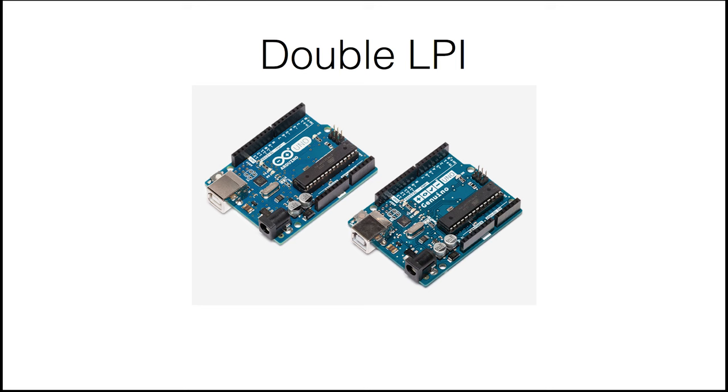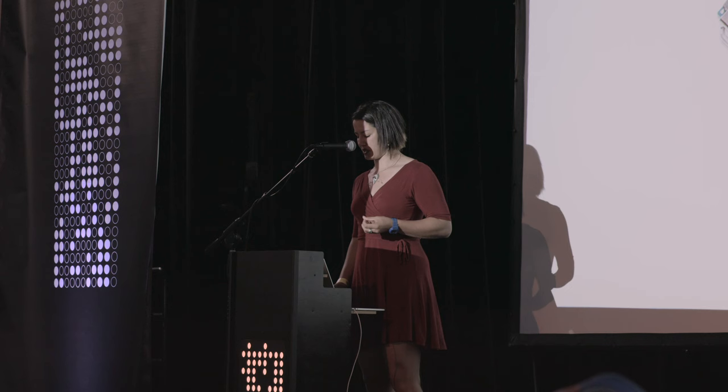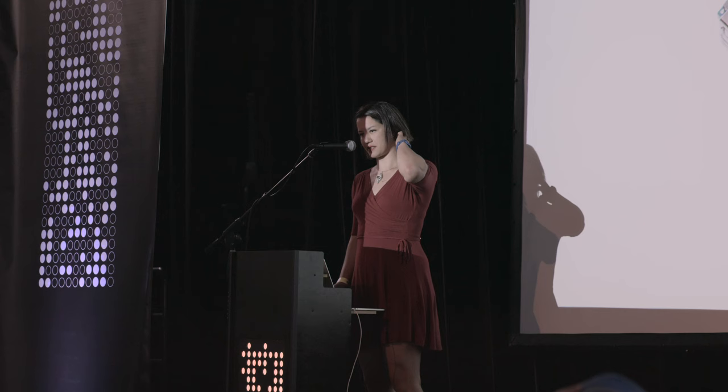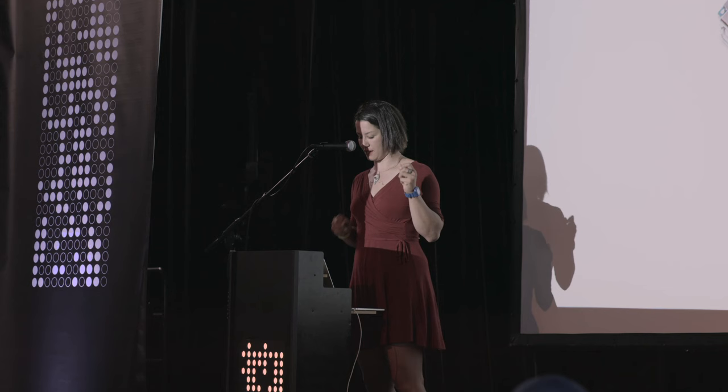This is another trick Arduinos used. They got very crisp text. And when I first saw an Arduino, I think it was 2007, it was noteworthy just how crisp their silkscreen legend was. And I found out at some point that was accomplished by not using silkscreen at all. They had actually managed to get two passes of solder mask, and both white and blue were, I think, done in dual solder mask layers.